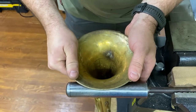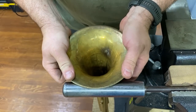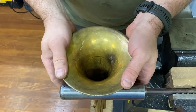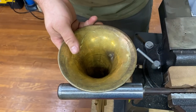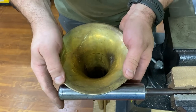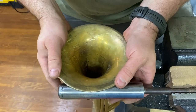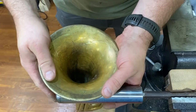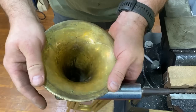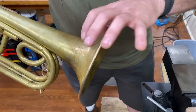It's a lot like questions we've gotten about compound bends and trombone slides — how do you get rid of them? Well, because your bends are going everywhere. The first thing you have to do is make everything going in the same direction, and once you have it going in the same direction, now you can work on getting it back straight. And that's what we're doing here — making sure that we get all of the parts of the flare going back into the same direction that we want it to go. Now we can make it all blend back together.